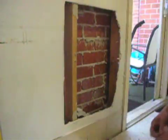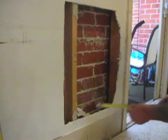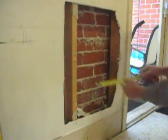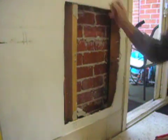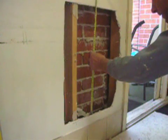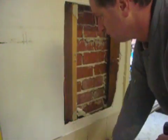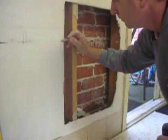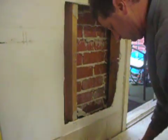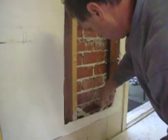In all my work, I try to eliminate as many tools and gadgets. I basically carry a tape measure, pencil, a saw, and a couple of saws in case I have to cut any timber. A lot of other plasterers might use timber. They frame it and they use screws and a screw gun, and you need all sorts of things, but this way I just back block, as I'm going to show you pretty soon once I get my act together here.